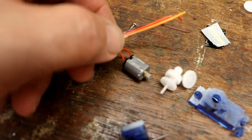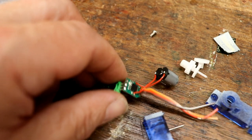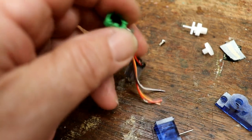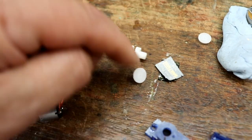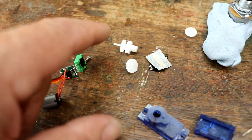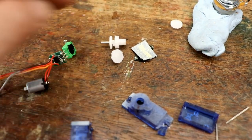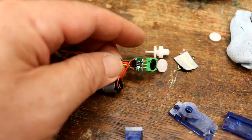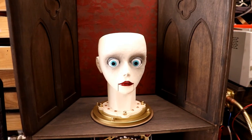Incredible. And there's the gears. There's the motor. That's connected to a very clever bit of circuit, and a potentiometer, a variable resistor. And then that little motor drives some gears, a long gear train, so it has much, much more torque, and it still goes pretty fast anyway. And then one of the spindles comes down and turns the potentiometer, which tells the circuit how much further the motor needs to move until it reaches your desired position. Thank goodness for that.